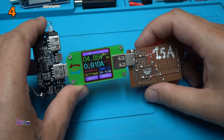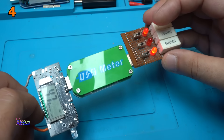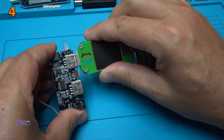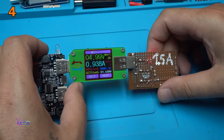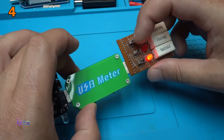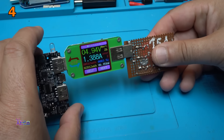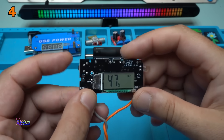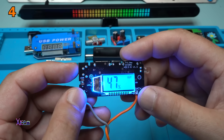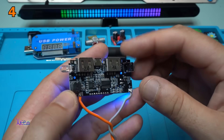USB output. Take a look — 4.85V pulling 900mA. That is almost perfect. Now I am going to hook up on port number 2, which is giving 2A — 4.9V, 900mA. And I am going to turn on the third resistor: almost 1.4A. The resistors are getting hot. Using this power bank module you can very easily make your own portable power station. It is a cheap module — you can get it for around 3 US dollars.